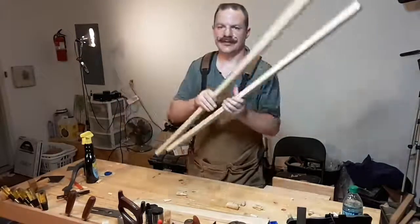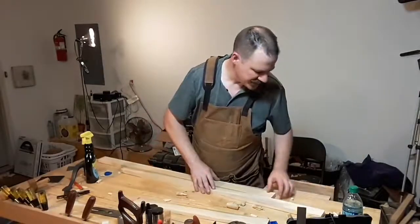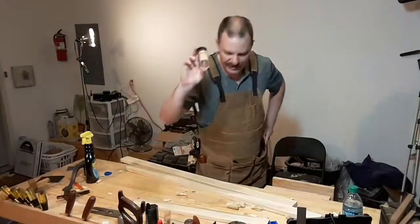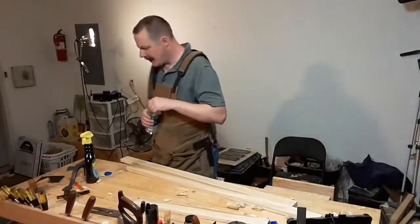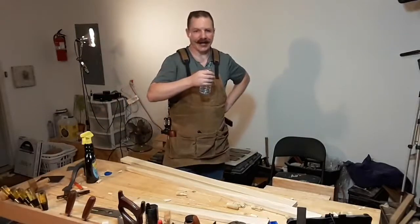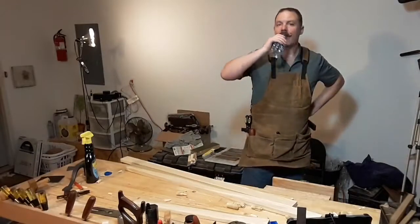And we're gonna have the shelves dadoed in. The whole thing is based off of these spice bottles right here, because all the spices have been relocated into these. So we need to have just enough room for the shelf, a spice bottle, and some clearance to pull the spice bottle off the shelf in between each of the dados.